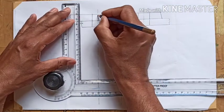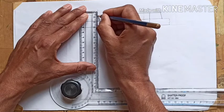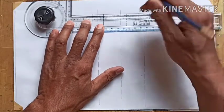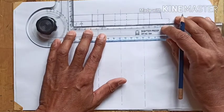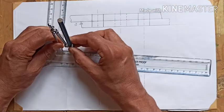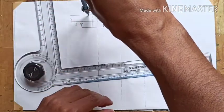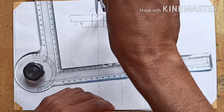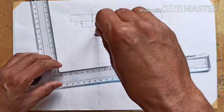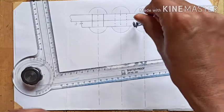Next is to find the center of the rivet — it is 3 mm up and 3 mm below from the top end. We can use the scale to repeat this for the other rivets in a faster manner. Now we draw the snap head by measuring on the scale. Keeping one leg of the compass at the center, we give the snap head arc. This is repeated at each rivet center — 3 mm below the line — for all rivet positions. This is how we give the snap head on all three rows.